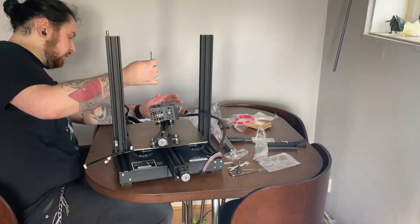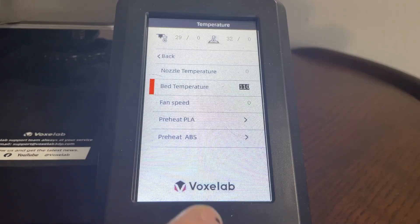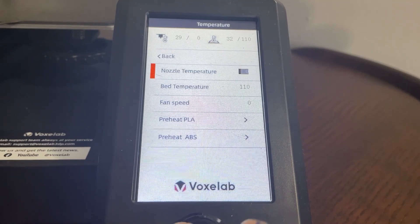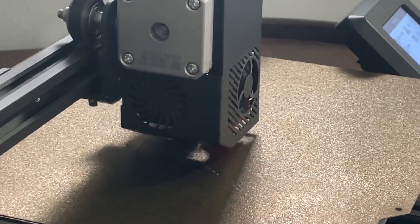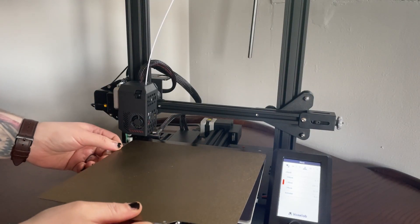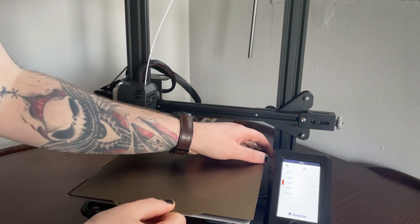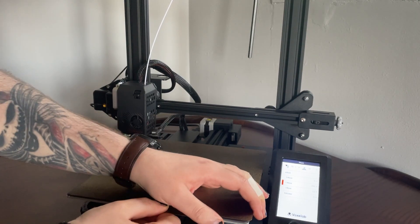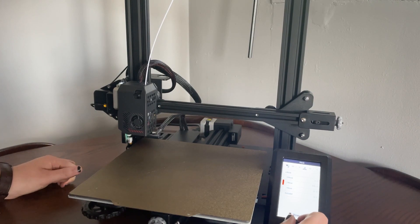Once it is put together, it's simply a case of inserting the SD card with your patterns on and it's pretty much ready to print. Some of the key features that make the Aquila S2 so appealing include its ability to work at insanely high temperatures, the fact that it includes a direct drive extruder, and that it also includes a magnetically attached removable build plate that features both rough and smooth sides. The smoother side is there if you'd prefer your prints to have a smooth base, while the textured side provides better adhesion if you're printing something that is going to struggle to stay attached to the printing base. This works mostly well, assuming that you keep external forces from interfering with your print.